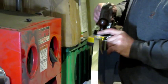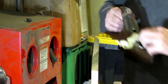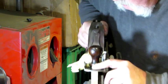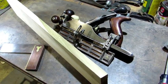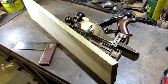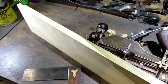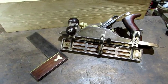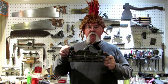Now this old beauty is starting to get serious. One more pass and I think it's done. That's pretty. So the old 386 jointer gauge and my Bedrock 605 did the job. That board is straight — it's been jointed and squared at the same time. All those ripply edges have been taken out. I checked it with my square and it is dead on. You just can't beat a couple hundred year old tools. The old 386 passed with flying colors.